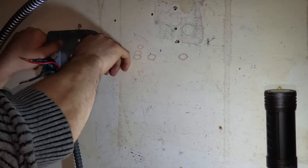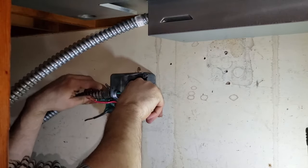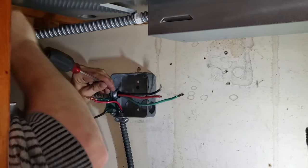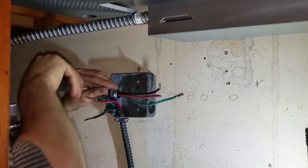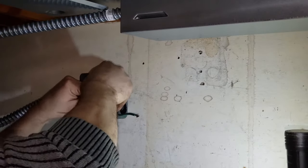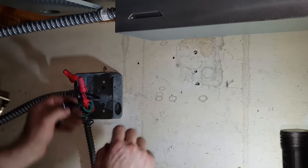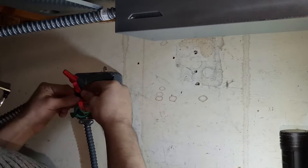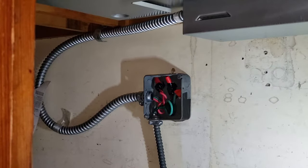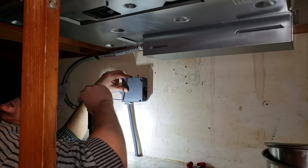If this is something you have to do, be sure to give it a hearty tug to make sure that you hit a stud and not just drywall. Next, I fished the cable through to this new junction box. I believe I used a 3/4-inch sized cable clamp with a correspondingly sized 3/4-inch knockout in this junction box. Using my meat hammer here, that's how I tighten the lock nut for the cable clamp. Next, a light amount of wiring: we join black and black with a wire nut, red and red, and green and green. I'm anal retentive and I like to create a little extra cushion of safety by wrapping the wire nuts in electrical tape for extra insulation. And to keep things clean up top, I installed a cable clamp to route the cabling. Don't forget to put the junction box cover back on — you may need to encourage a few errant wires to get back in there.